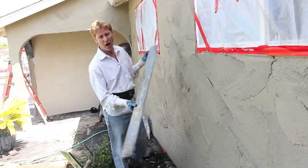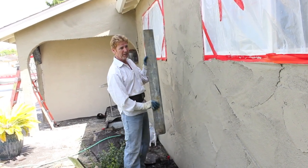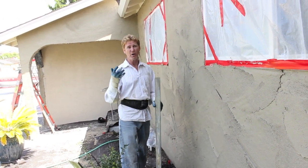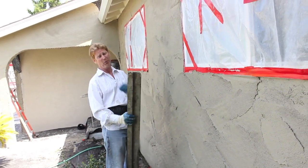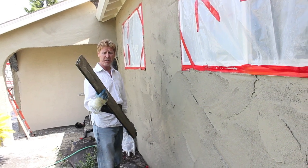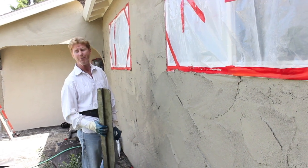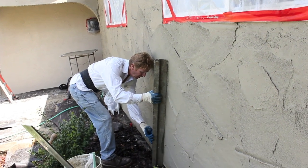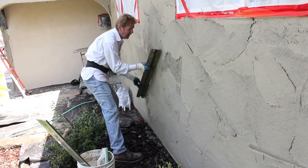When I work you need one guy on one level and me on the other, and we take a 10 or 30 foot rod to rod walls - banks specifically where they're gonna put imitation tile - and that wall had to be true and plumb within an eighth of an inch or we'd get yelled at. My buddy was emailing me saying in Australia all they use are straight edges and it's hard. This is how we used to do it on union jobs - you take it, go here, pull it up, and you just keep doing that. It takes forever.